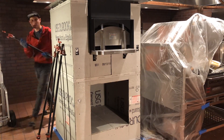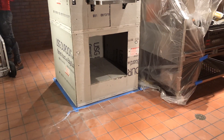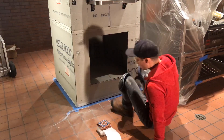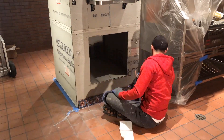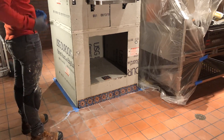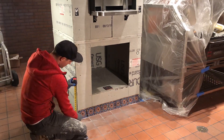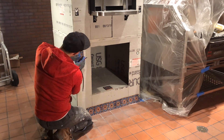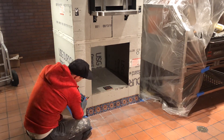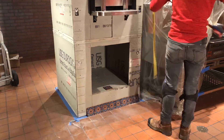After I let my silicone and epoxy dry, I take the bar clamps off and start accounting for my layout with the tile. The tile I'm using is this beautiful Talavera tile — there are two designs: one is more decorative and the other is a cobalt blue, which is just absolutely gorgeous. Because the top of the oven is more eye level, I want to ensure I have a full tile at the very top and cut accordingly. I do account for shim thickness, so make sure you don't forget that one as well.